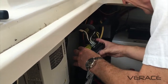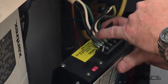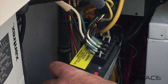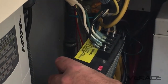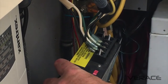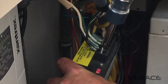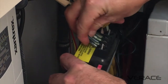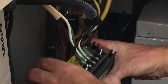My ground is over here — the green — that's my neutral, and there's my hot. I did turn off the AC breakers at the back of the boat, and I just measured the AC to make sure I have absolutely no AC going in there. That's really important because you're working with live 110, which could be fairly lethal.